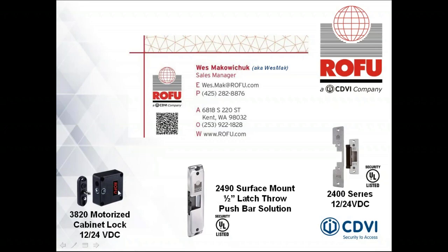The motorized cabinet lock is a 12 or 24 volt DC solution, so you can power that with the panel. It suits medicine cabinets, pharmacies, file folders, that kind of stuff. So this little unit is a very nice little locking device. Also included in this unit is a magnetic door contact, so you have the capability to monitor whether the file has been opened or not. So you're monitoring for a forced cabinet instead of a forced door. There is a door contact included in this unit.